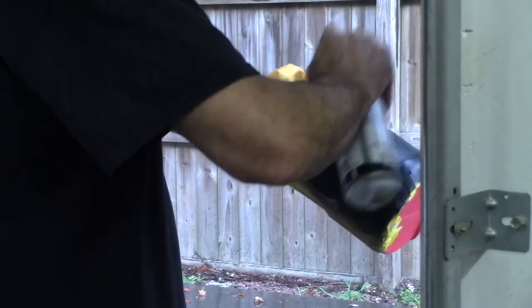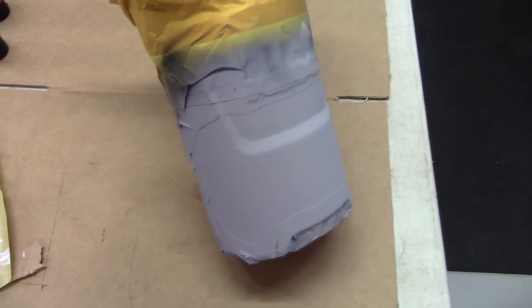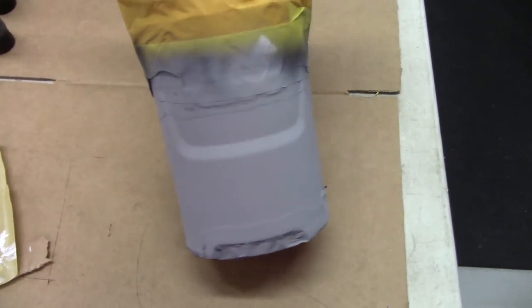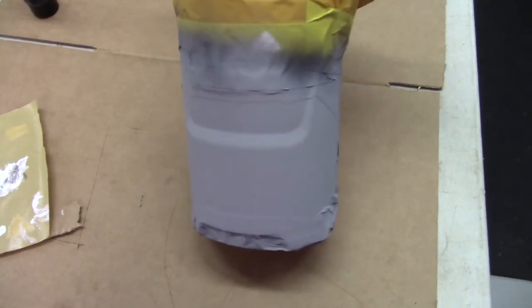Another 24 hours later, this was dry, so we sanded it again, and then added primer sealer. This layer essentially acts as an adhesion promoter for the top coat layer of color to stick. It's mostly used in cars and such, but we decided to use it here too. This layer didn't require as long to dry.